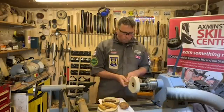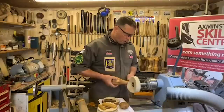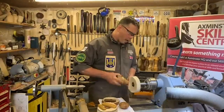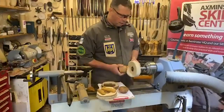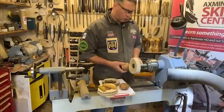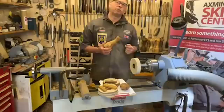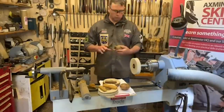A little bit of Carnauba wax if you want a shiny finish. Remember, we're waxing over oil, but the oil's dry. If you try and wax over wet oil, you're not going to get the success. All right, and what this is doing also, the oil's designed to seal and raise grain. So as we take the grain away with the buffing, you get a really nice silky finish.